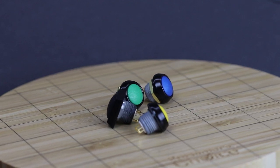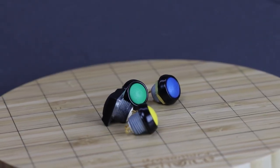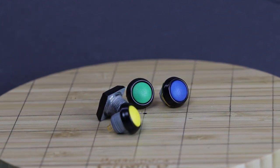I really do love these ITW switches and I keep them in my Element 14 shopping cart so I can get back to them quickly. I keep reusing them because I already have the dimensions, specs, CAD models, hole sizes, and physical experience with them — I know how much force it takes to push them, what they're made of. It's hard plastic and metal. That means I can plan and prototype much faster without hunting down the right switch or verifying datasheets. Work smarter. And this thing needs to be rugged.